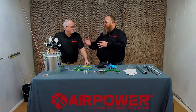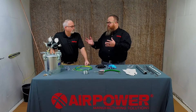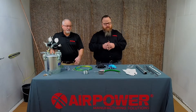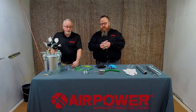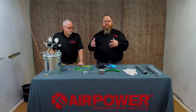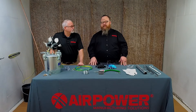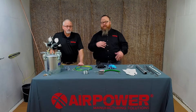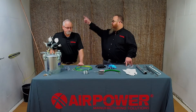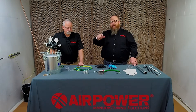The Faraday area, even if it's grounded, is still difficult. The Faraday phenomenon is there no matter how good the ground, but it allows you to paint better if the substrate is well grounded. When I was in the paint market troubleshooting powder coating, the first thing I did was trace ground all the way back to the original source. I would find the ground rod that was buried in the ground with just that much exposed on top.